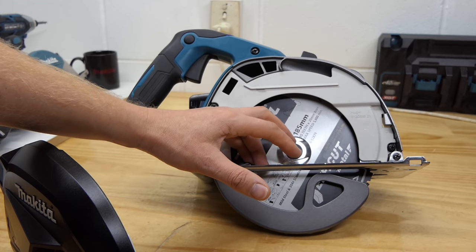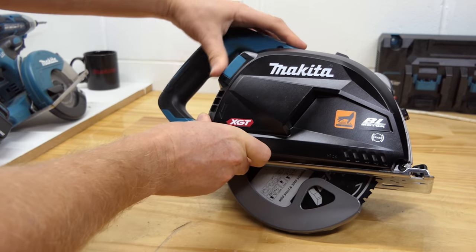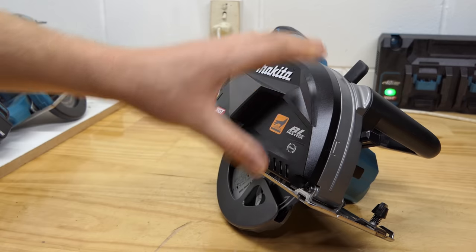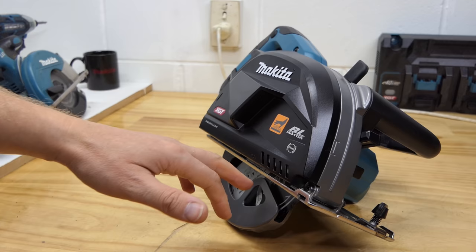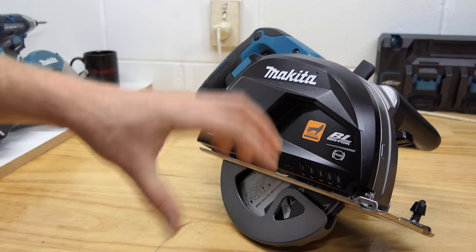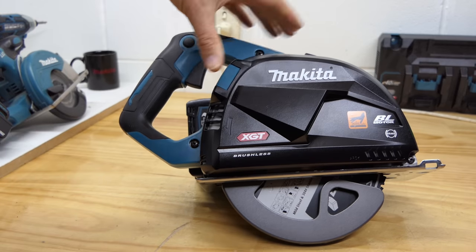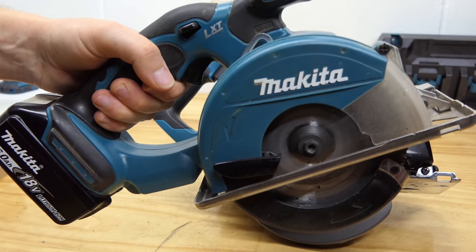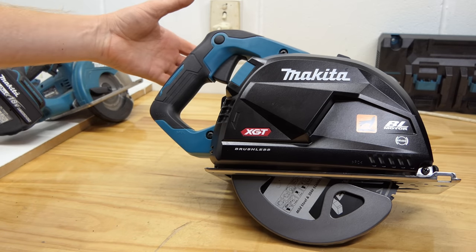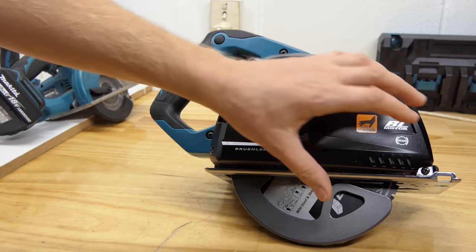5,000 rpm — you might be saying, what if I put it on my circular saw rated at 6,000 rpm, will it explode? How slow is this saw? Metal cutting circular saws run at a slower speed than a standard wood cutting saw, which is why you can't just chuck a metal cutting blade on a lot of regular saws. Some Makita 40 volt saws run at six and a half thousand rpm, which is just a bit too quick for cutting metal — you want to be a little slower, more careful. You don't want a blade to catch when cutting metal; it's a totally different story to catching when cutting timber. This saw only runs at 3,500 rpm, which is 100 rpm slower than the old 18 volt brushed version. This one is of course brushless — I shouldn't need to say that by now.